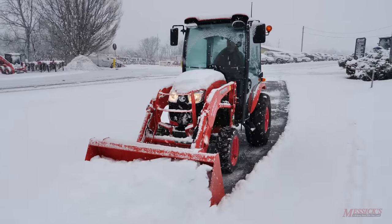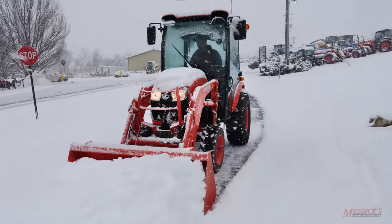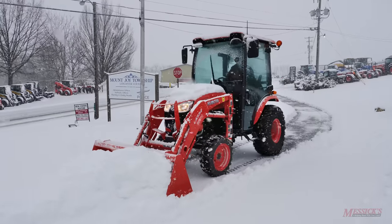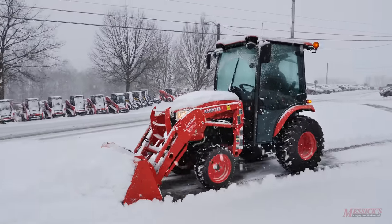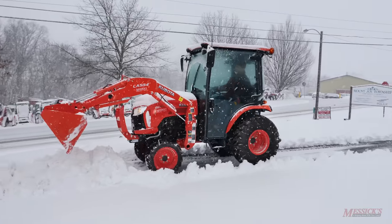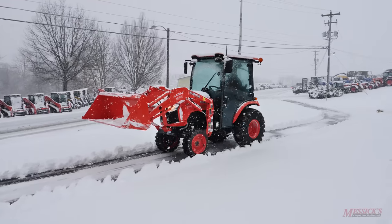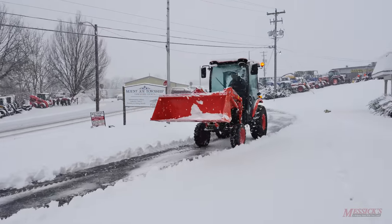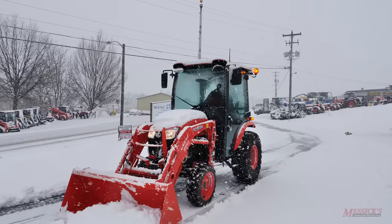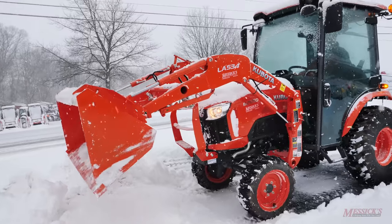We've got about three inches right now, which is the real application for somebody with light snowfalls. You can see the further I go, the bigger pile of snow I'm getting in front of my tractor. The easy way to get rid of that — you could pick it and bucket it off — but I'm just going to build up a big pile in front of myself and push right off the side. Then we can pick and dump and start to build a pile there. I'm running in medium range. If you want a little more speed, you could go in high and fly back and forth. But this is basically the repetitive motion — take that bucket, throw it in float, and push forward with the cutting edge doing the work to scrape off the ice and slush off your drive.